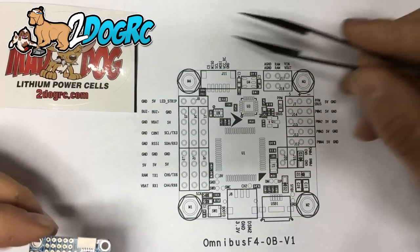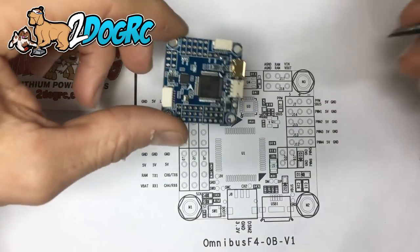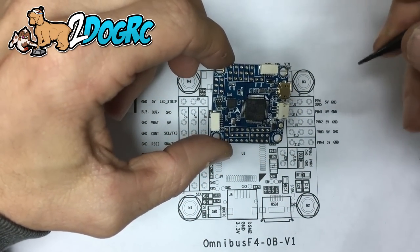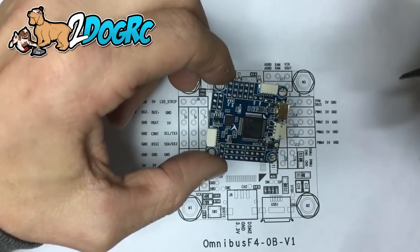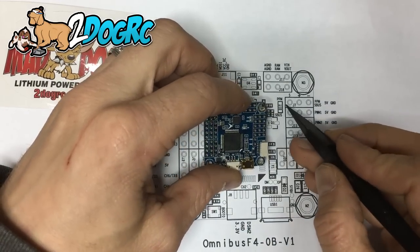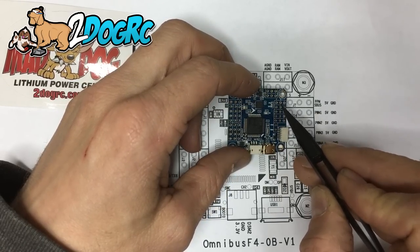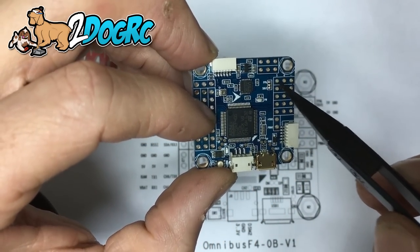I've got the layout here — this is on the website, the pin out of the board. I'm going to start simply here with what I do first, which is hook up my receiver. I use an XSR or XM Plus, or some serial or S-Bus receiver. This would also work if you're using Spectrum. According to the pin out, this first row — J7 — that's where you're going to put in your receiver. Signal, positive, ground. Very simple, just like the diagram: signal, positive, ground.